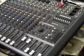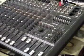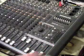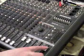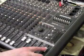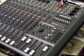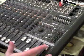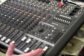This fader here, on some desks you have two, a left and a right for stereo. On others they're brought in together and put into one fader to make it easier to operate, so you're not messing about with two. And that obviously controls the main mix level. Again, when you're setting up your levels, you would normally have that up near unity gain, just about that position there. You'd set the overall volume with your amplifier or your powered speakers, and then you could use this to boost that. You're getting another 10 decibels of boost, which I think equates to a doubling in sound.